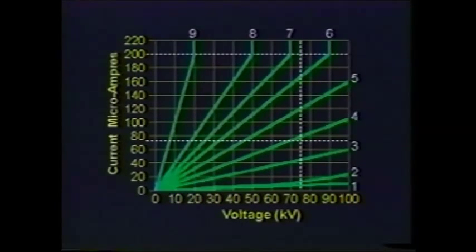To set 200 microamps as the accept-reject level would come as close to approximating OSHA requirements as possible. However, there may be situations where an unusually contaminated tool might only measure 180 microamps prior to flashover. Since we are using a reduced voltage and must be sure to always meet or exceed the OSHA requirements, we have to set the pass-fail requirement of leakage current at 75 microamps.